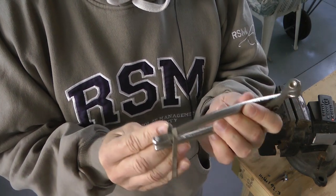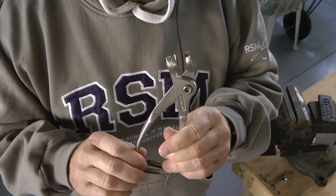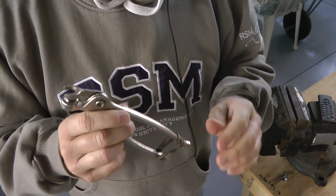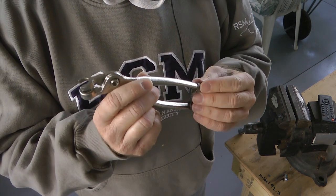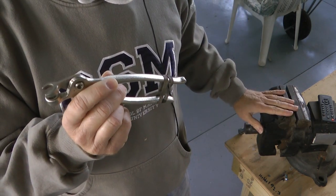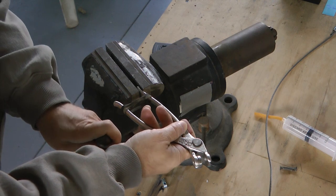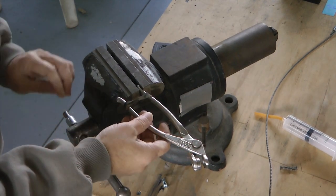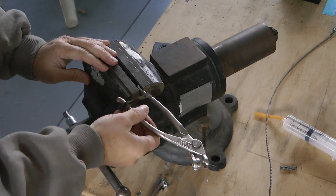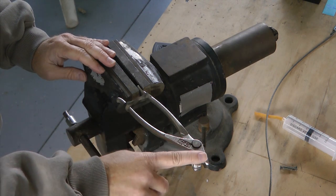Give it a little bit of tension on there, then we're going to attach one of the arms of the cleco pliers to a vise and set it up and squeeze it in place. We've got that nice and tight, and we still have the arm that's free.